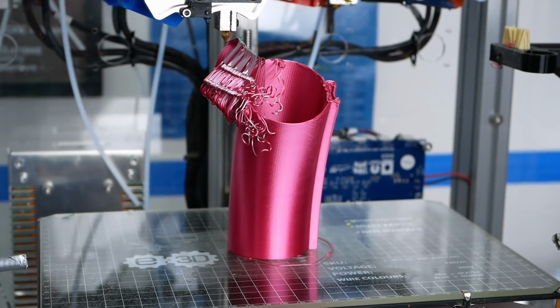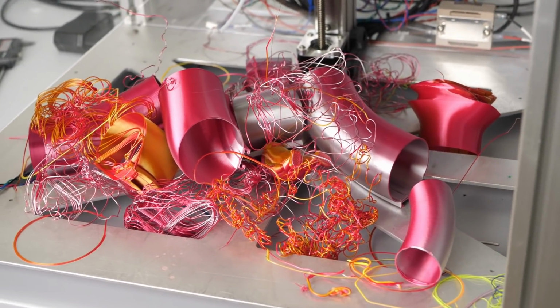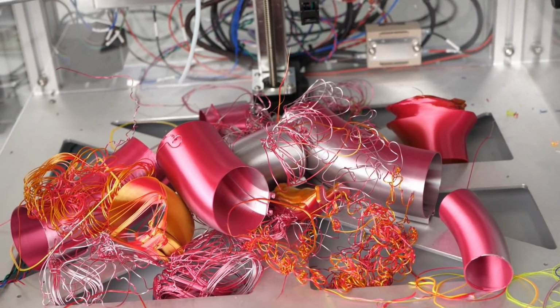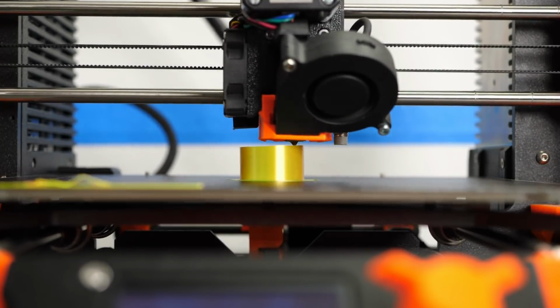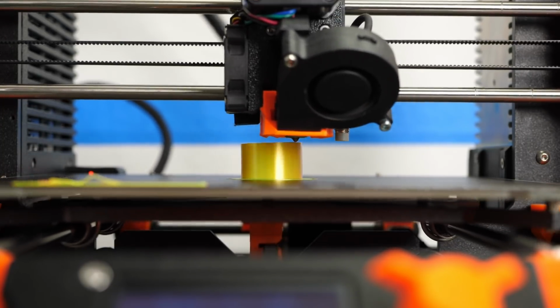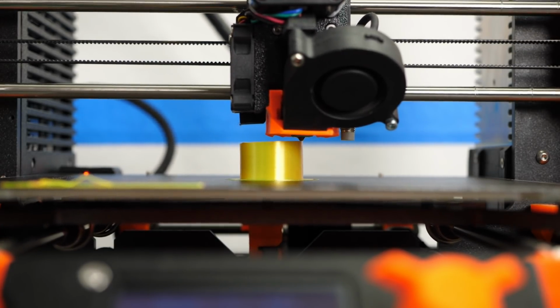You might have already noticed it, but non-planar printing comes with its own challenges. If you don't have a way to tilt your print head, you are quite limited in the slope that you can print. Most obviously, there's clearance. I first started printing on my Prusa, but quickly noticed that the fan shroud and the bed sensor are so close to the nozzle plane that barely any non-planar printing is possible.